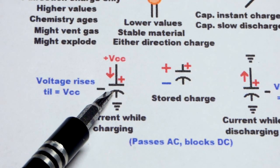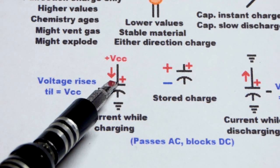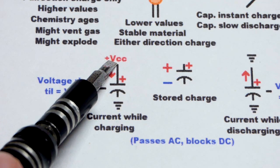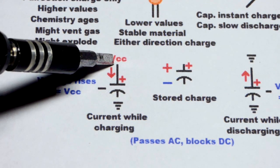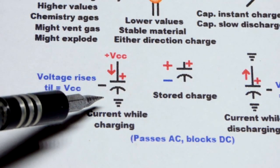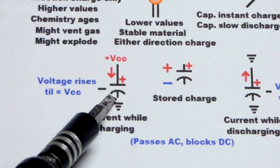Probably most of the time in a circuit, a capacitor is storing charge from the power supply. So if you connect it directly to a voltage source, current is going to flow — a high amount of current — and it's going to basically charge instantly, pretty close. They used to think that current was a positive fluid moving from the positive side of a circuit towards the negative. Now we know it's actually electrons moving from negative to positive, but we still talk about conventional current because that's how analysis has evolved. In any case, that side gets more positive, that side more negative as current flows, because there's a charge imbalance. There's a direct relationship to how much charge there is — if you have twice the charge imbalance, you'll have twice the voltage. But larger value capacitors take more charge to get that voltage, whereas smaller value capacitors take less charge imbalance to get a certain voltage.